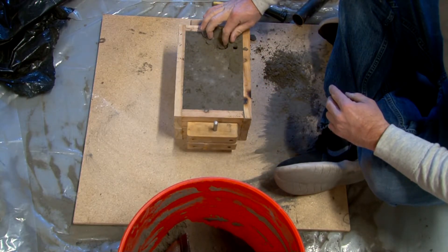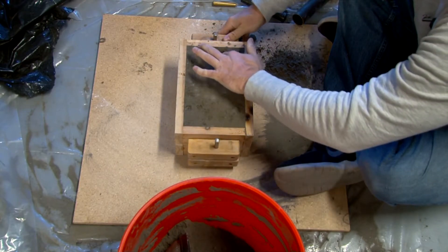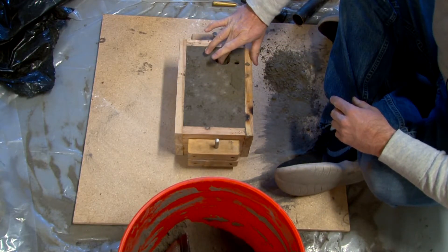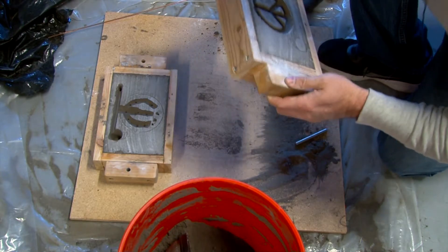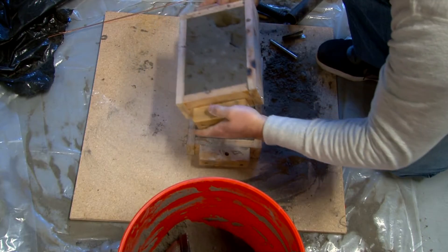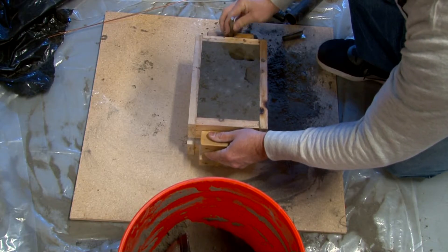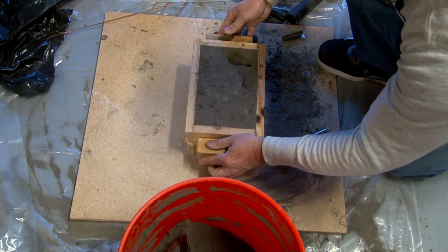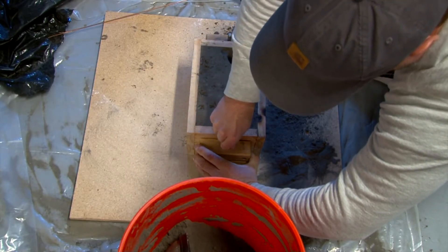The other thing that's amazing is you can pour a lot of aluminum down that little sprue. My sprue is around nine millimeters in diameter on average. It starts off large at the top and goes down smaller, so that it doesn't pull air with it and cause air inclusions or voids in your part when casting. Just doing final inspection, blowing some leftover sand out. This is where you hope you don't have any sand accidentally falling into the cavity. I'm holding it up to find the center pin location to put the lock pins in the sides. I've got to find a different mechanism — the wood swells up sometimes, making the pins hard to put in, and then you have to take a drill bit to remove them. But that'll be another lesson, another learning experience.